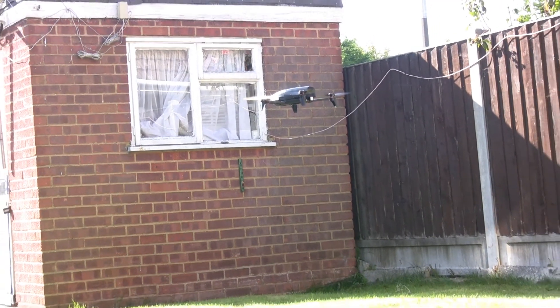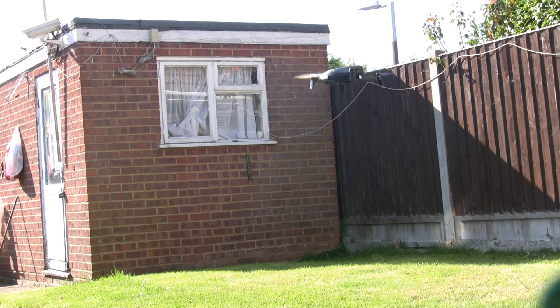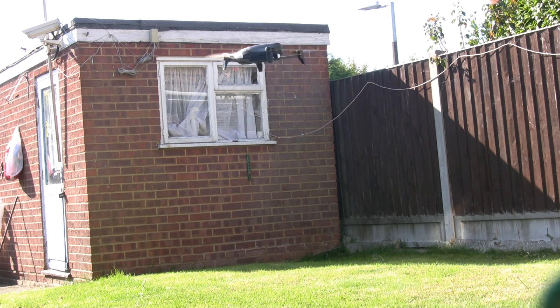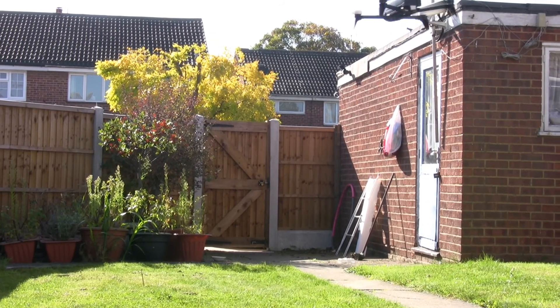Overall, the drone's flying and working fine now. But for anybody else considering buying any quadcopter that's been in salt water — unless somebody's got the battery out of it pretty promptly, and then the owner has thoroughly washed it out with distilled water, or at minimum fresh water, to get rid of the salt deposits and let it dry out — if you just let it dry out on its own, it's just going to corrode to hell like this one did, and it will be 100% beyond economical repair. To actually get this one running, it technically needed a brand new board and a brand new GPS board. The bearings aren't so bad since they're quite reasonable, but with the main board and the GPS board, you're looking at the price of one of these brand new. So it's definitely not worth a repair under normal circumstances.